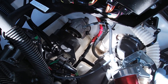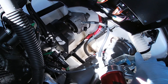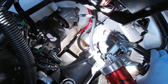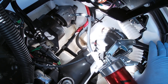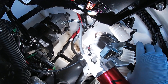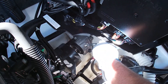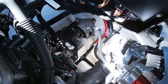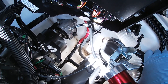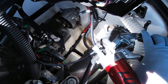I'll be quiet so maybe you can hear the noise in there. There's just a little bit of grease coming out — I can't reach all the way down to hold it. So far I've got three pumps in, no grease coming out. Four pumps. Five pumps. Six pumps. I hear grease moving so I'm going to stop — I'm at about seven pumps.